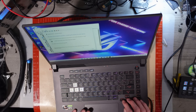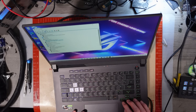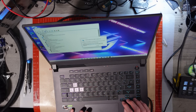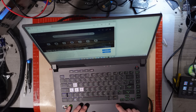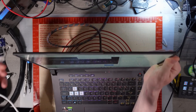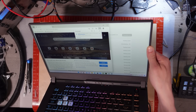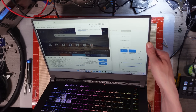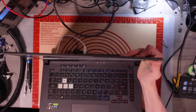There are driver issues for sure — I can see NVIDIA virtual audio device with problems. Let me disable and uninstall that driver and remove it. The download is still taking a while so let's switch to Ethernet. Good news: the battery is now being detected. Previously it wasn't showing at all, but now it's picking up a battery.